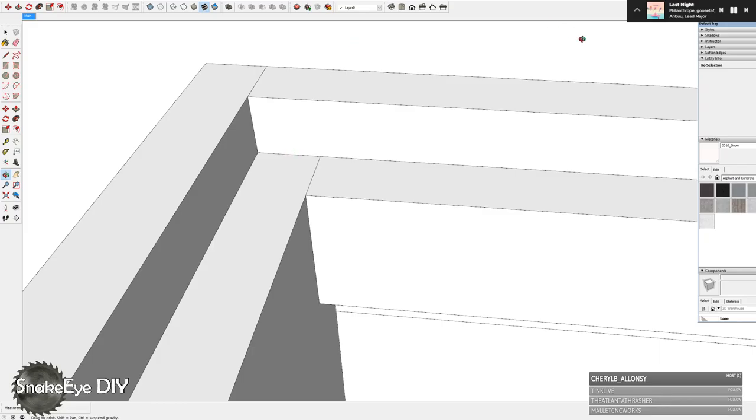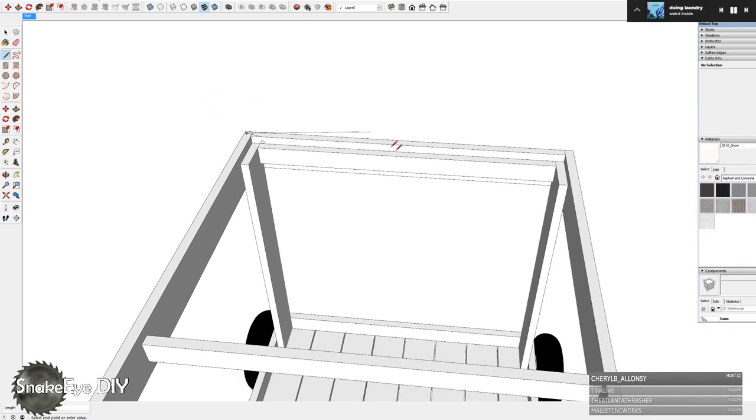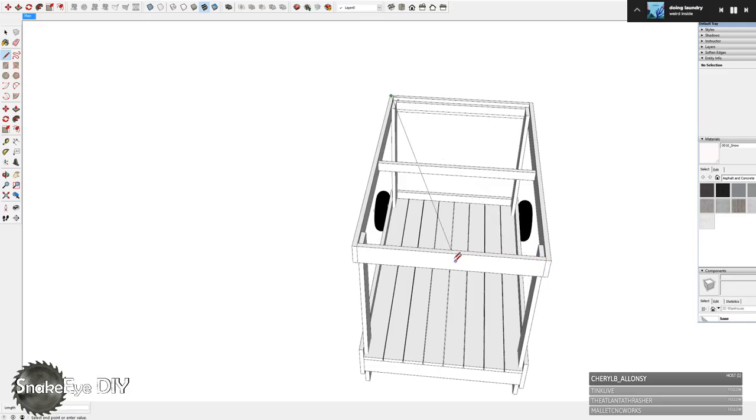Come through? So it would only go through each corner, right? It wouldn't go through all three boards, right? No, the pocket screw would essentially go in right here, or probably further out. So two sets of pocket screws in each corner. Yeah. They'd probably go in like right there, and then the screw would go in like this. So that would be where the screws travel. And then you do one on this side right here and one at the bottom. And then you do that for each of these. Do that here, here, and on that side.